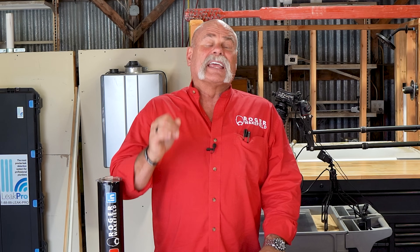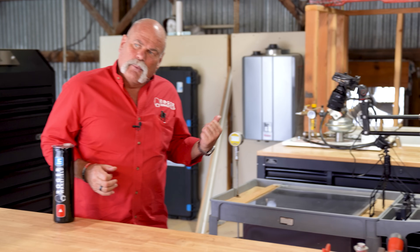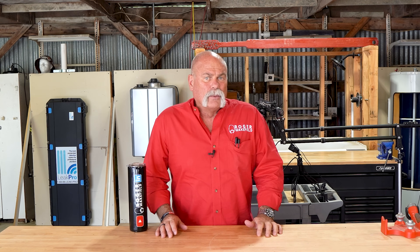Most potable water systems in a house are soldered. Now we're gonna go into more depth. I'm gonna show you both, and as you can see we've got the blast chamber set up. We're gonna pressurize them up as high as our hydrostatic pump will go, which is about 10,000 PSI.